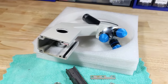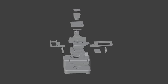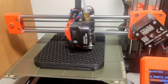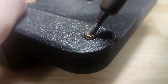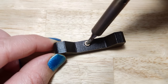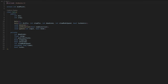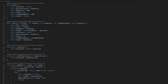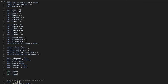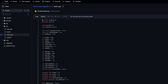At this point, I went on to design how the microscope should look, how it should work, and what parts needed to be 3D printed — and then I 3D printed the parts. I also designed in the use of some heat set inserts for tighter bonding between the parts, as rigidity is quite crucial for a good functioning stepper stage. I then wrote some code for an Arduino Nano to be able to actually control the different stepper motors. I spent maybe 2 or 3 hours on this code, so please don't look at it — it's ugly, but it is available on my GitHub.